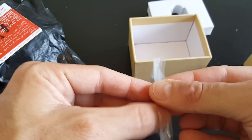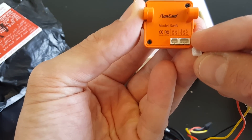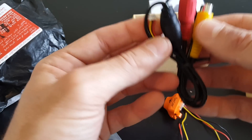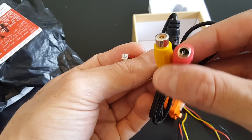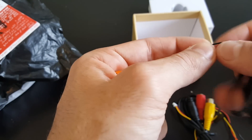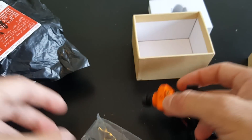In this bag you're getting all the connections needed to connect the FPV camera to a TV and to your quadcopter. This cable connects to the ground, plus voltage, and to the video. This cable is used to wire the camera to an external video display — the yellow is the video output and the red one is used to power the camera. Make sure that you use a power source of 5 to 17 volts. The last cable is the OSD joystick used to go through all the settings of the camera; I'm going to show you how to use it in a second. It's very easy — just plug it on the left side and you can go through all the settings, which display on your monitor or FPV goggles.